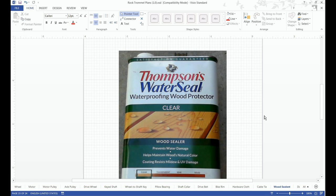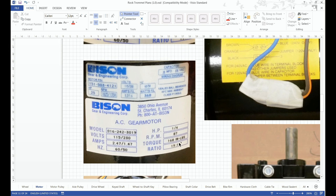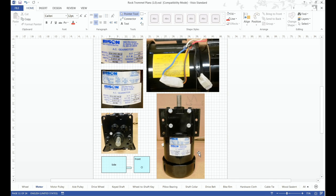One final note regarding the electric motor: I went with a quarter-horsepower and was fortunate to find a Bison motor with a reduction gear built in, so I didn't have to worry about reducing a high-speed motor — typically around 1,600 RPM — down to 20 RPM. I found it at a pretty good price and everything worked out really nicely. I wish you all the best at building your own trommel. Thanks again for watching.